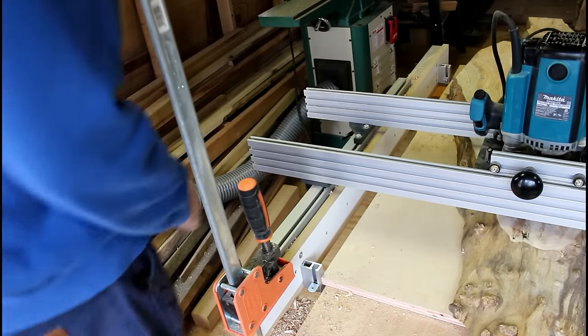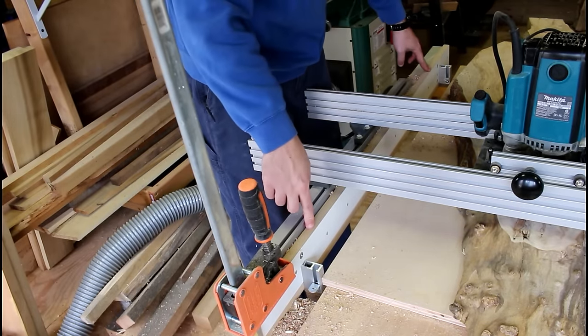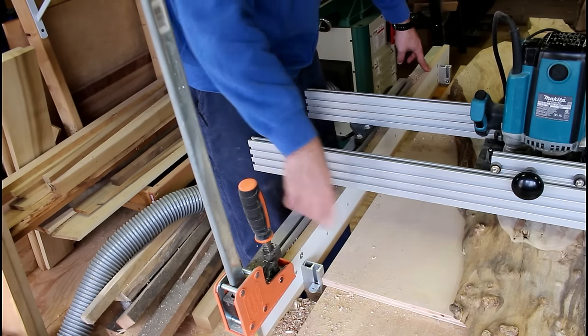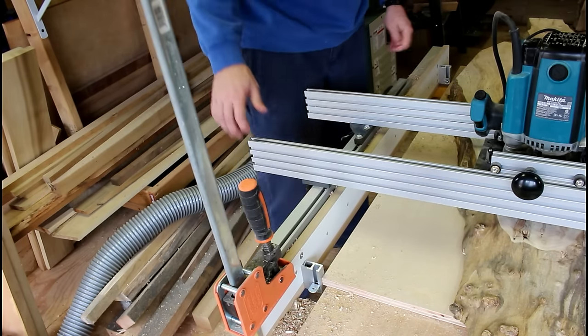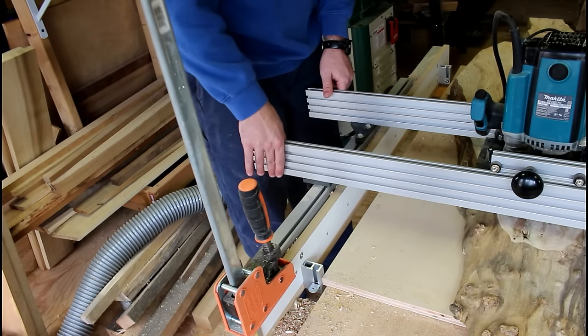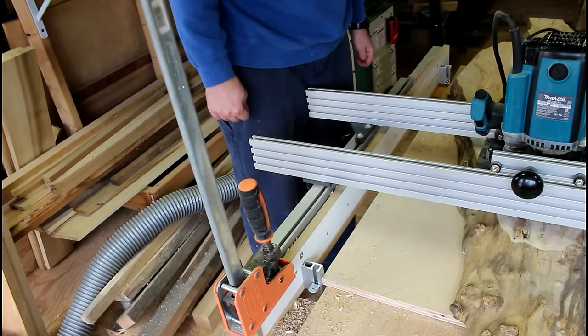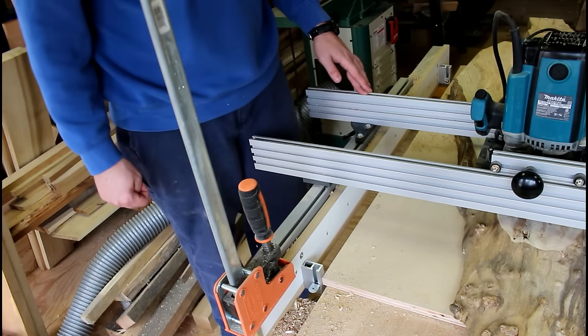And then these rails here, made out of MDF, I got them as well with it. I got them clamped down to these sawhorses, and I got the work resting on two sheets of birch plywood, so it's nice and stout. It slides here on the rails real easily, and it's pretty easy to use, just time consuming. You gotta set everything up. Once it's set up and dialed in, you can flatten the slab pretty fast.